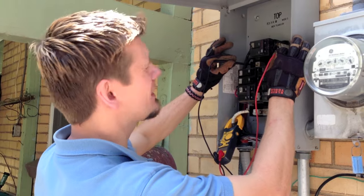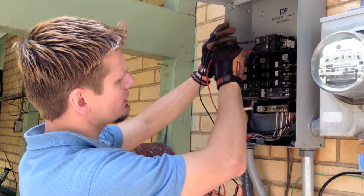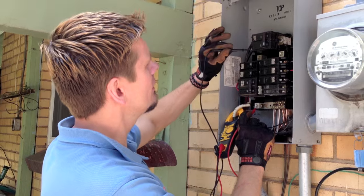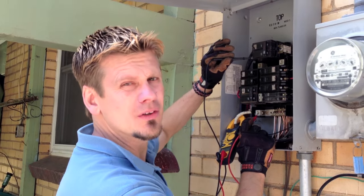Whether you go here to here, you're getting 248 volts, or you go here to here on the breaker — 248 volts. Now from phase to neutral it should be 120, and on B phase also 120. Keep in mind it's a nominal voltage — you can get from 110 volts up to 123. If you start seeing it around 127 volts, you're going to start popping light bulbs.